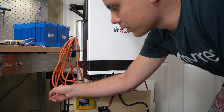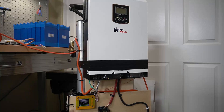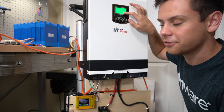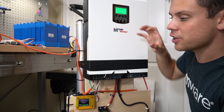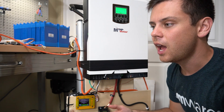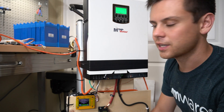We have an extension cord on this side for charging. If I plug this into a wall it will start charging instantly. Right now it's charging and I have it set to 40 amps — it can actually charge up to 60 amps, but because of the size of battery I'm using, I prefer charging at 40 amps to avoid the effects of fast charging degradation.